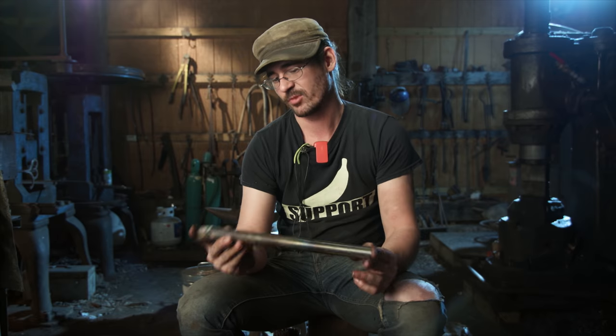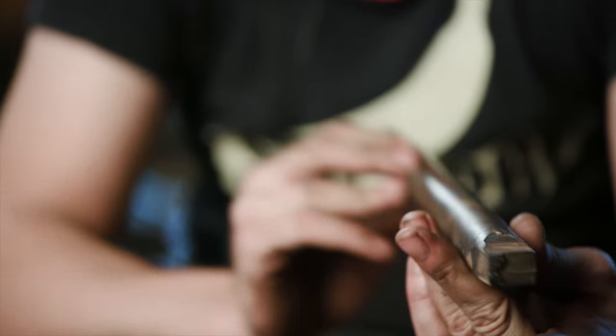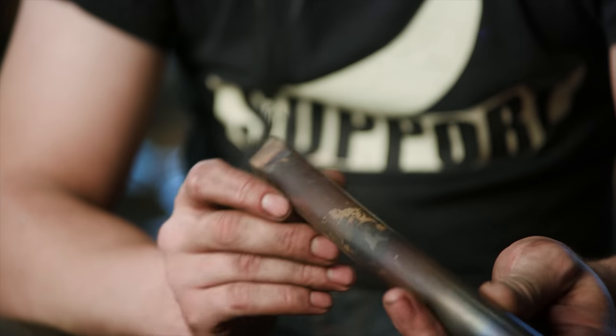This is a piece of titanium. It is 1 inch round, and I have about 13 inches of it long. This is exactly enough to make Blade's sword. Titanium has several advantages. It has half the density of steel, and it is resistant to heat. However, titanium is actually a suboptimal material for blades. It does not get as hard as steel, meaning the edge retention is not so good. And it's a pain to grind.